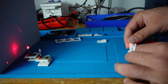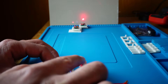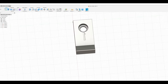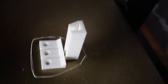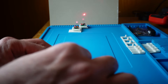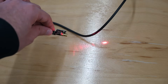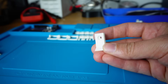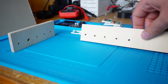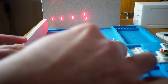While doing the test, I ran into a problem: the laser beam wasn't aiming correctly and wasn't hitting the sensor. At first I thought the issue was with the 3D printed parts — maybe they deformed during or after printing. So I designed the parts to be bigger, hoping that would reduce any bending. I also switched the printing material from ABS to PLA, since PLA prints more easily. Even with the new parts, I still had problems getting the laser to aim correctly. That's when I started suspecting the problem wasn't with the printed parts, but with the laser module itself. To confirm, I tried drilling holes perfectly vertically in a wooden board to make all lasers parallel, but in practice the laser beams still weren't parallel.